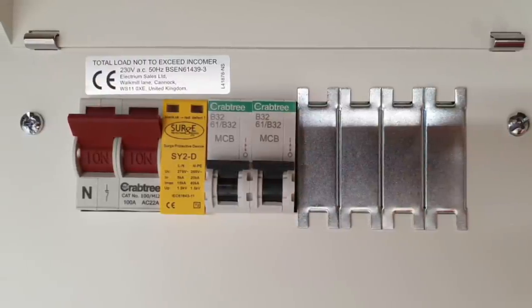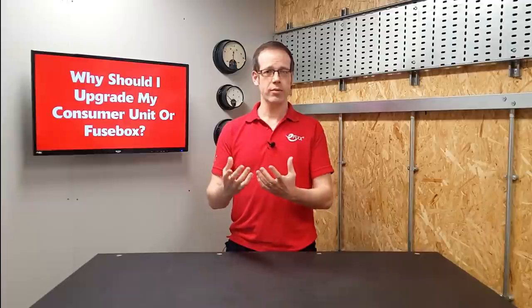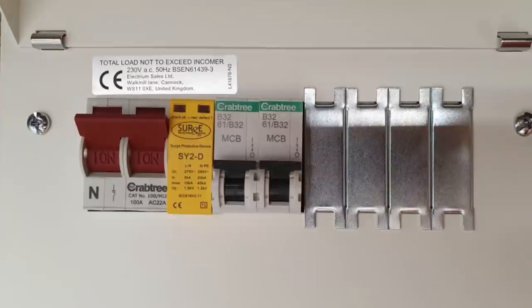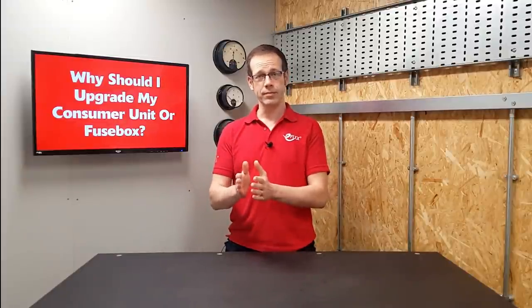While this type of fuse box does offer something in the way of electrical protection, it is far from ideal for protecting you and your property. A more modern solution is to use the miniature circuit breaker, or MCB. If your board looks like this — with a big main switch at one end and lots of these breakers — then you've got slightly better protection than the fuse box. These protect in the same way as fuses but are quicker to react to big faults without overreacting if a circuit is slightly overloaded for a short period. They can't be easily replaced with the wrong size breaker by an inexperienced person, and they can be reset after a fault has been fixed. However, one thing they do not do is protect people from electric shock — they're designed to protect the electrical installation from damage and properties from fire, not people from harm.